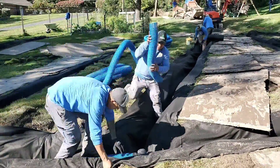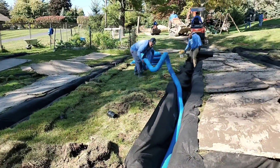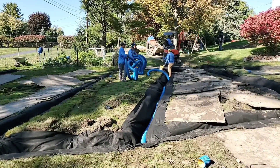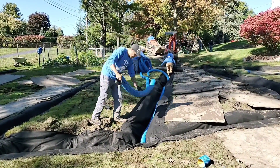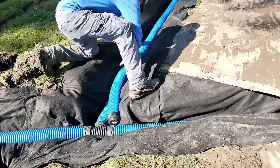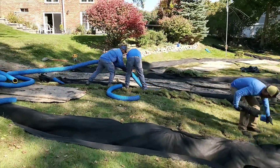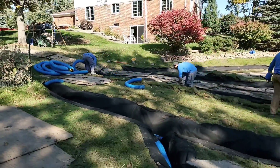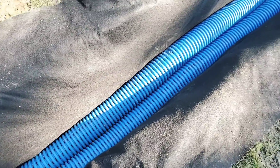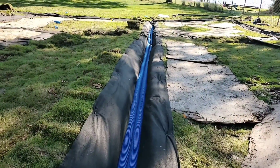You can see the connections — the guys just cut out a piece of pipe and put their fitting on, whether it's a T or a Y. It doesn't matter in a French drain grid because it's going to be pretty low volume. Once you grid an entire yard, you're not running all the water through just one French drain pipe and one trench, so it's going to be low volume. You're not going to need Y fittings like we use in downspouts — though of course, if you have a French drain coming in on an angle, a Y fitting will work really well.